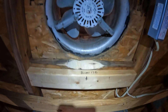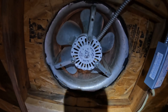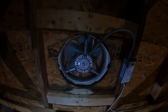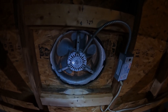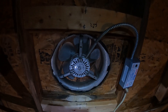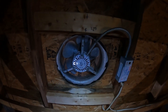What I did was carve a little piece out of there to make sure the airflow is good, because this fan is 15 inches — I'm transitioning from a 17-inch QuietCool to a 15-inch. By the time I get the vent covers on, we're going to have a really great solution at low wattage. This one here is a Lamanco at 374 watts pushing 800 cubic feet per minute.